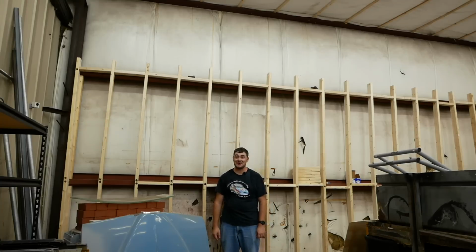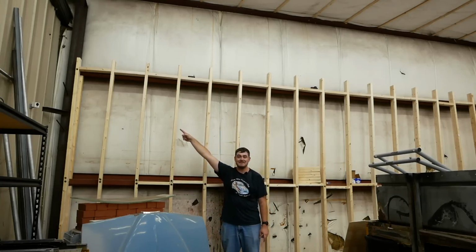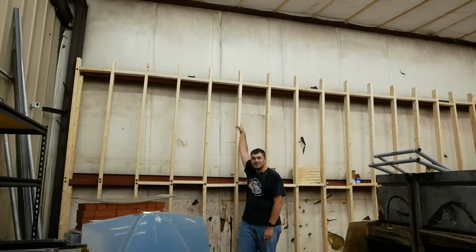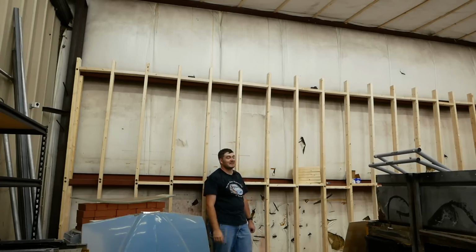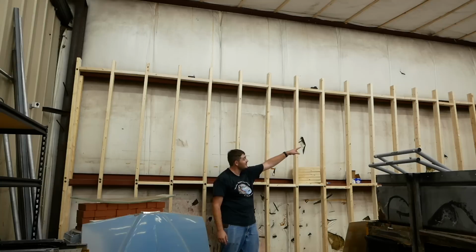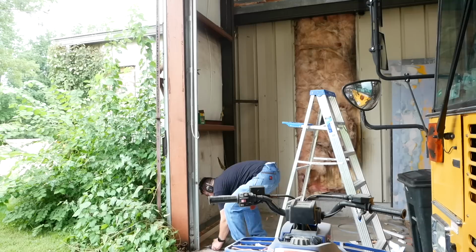Can you see what I did wrong? When I put in all those top spacer pieces, I started with a misaligned board, and that propagated all down the line, so all these vertical pieces have a slight parabola to them. Not going to really affect anything, it's just annoying and embarrassing. And I didn't notice it till all the way down there, where I put in that shorter piece to straighten things out, but there were only 3 boards left when I did that.